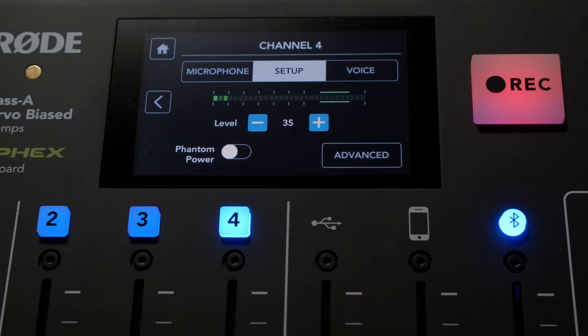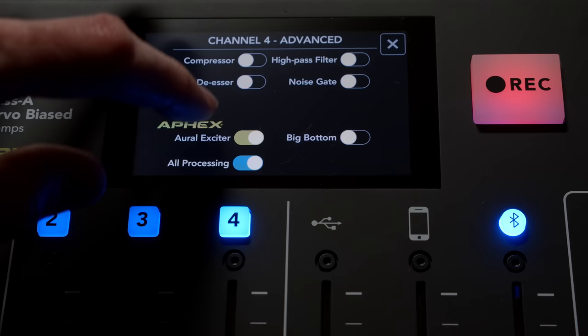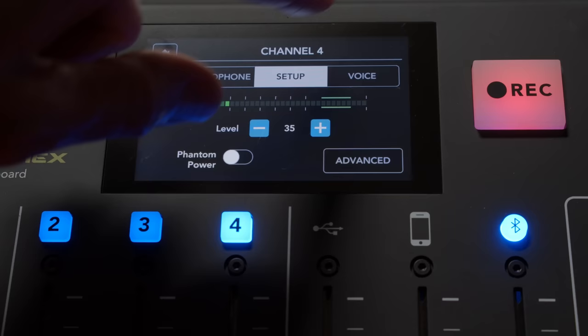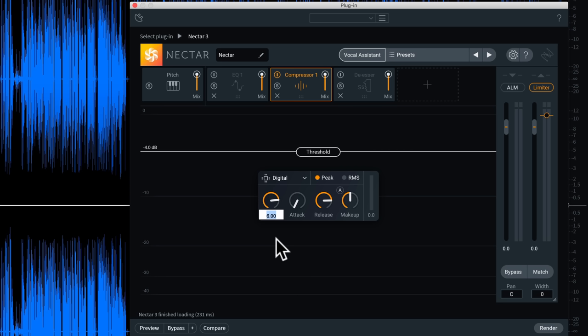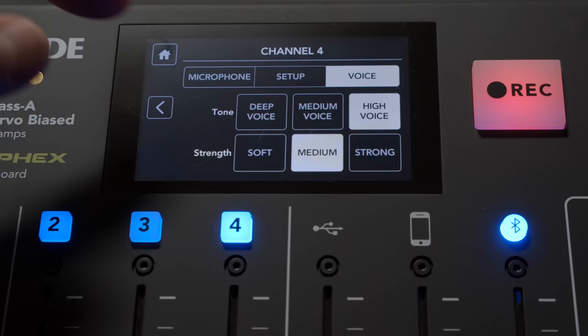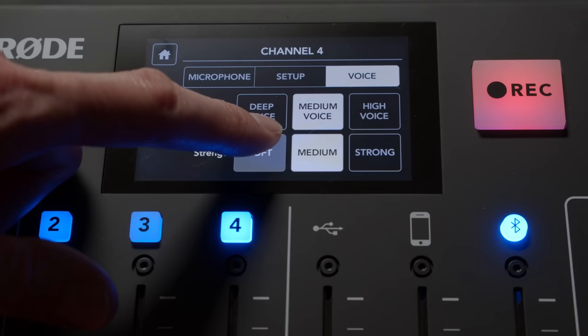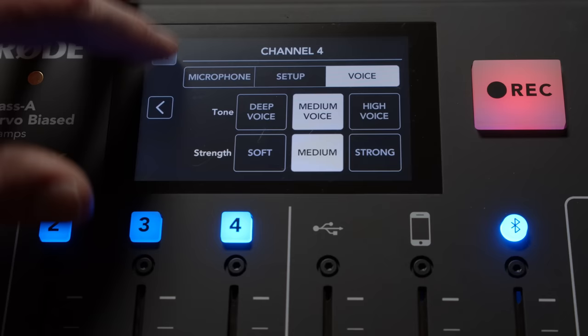This device is really, really good for those people that don't want to do a lot of fussing. If you come into the advanced menu and set up all of these different settings like the compressor, high-pass filter, and so on, you also go over to the voice menu. This is how you essentially fine-tune those settings. When you turn a compressor on, normally there are a variety of settings you have to change to fine-tune it. Here, instead, you have the ability to set basically two parameters: number one, the tone of your voice — whether it's deep, medium, or high-pitched — and then the strength of your voice, whether you're a soft speaker, medium speaker, or project really loudly. Once you set those two settings, that essentially fine-tunes all of the other settings like the compressor and noise gate. It's an interesting approach — you do have some ability to change settings, but not in the traditional way that audio engineers are used to.